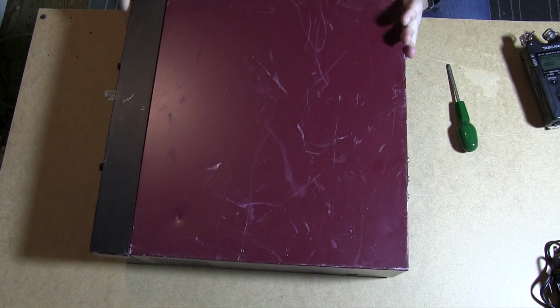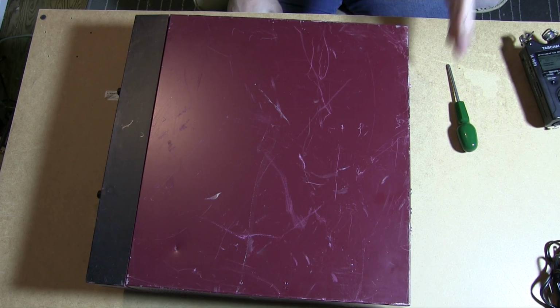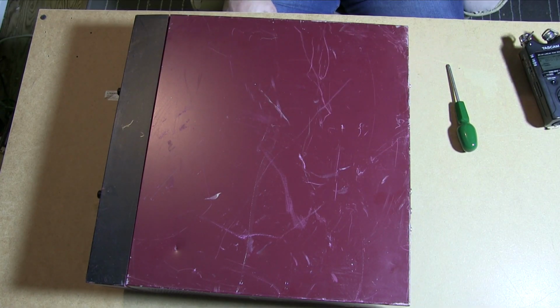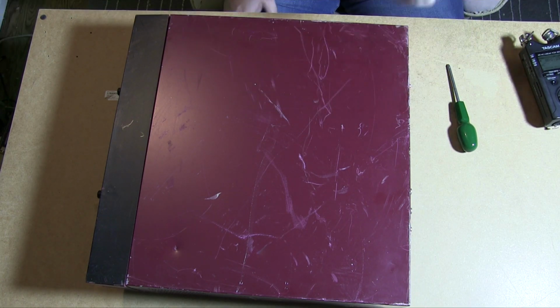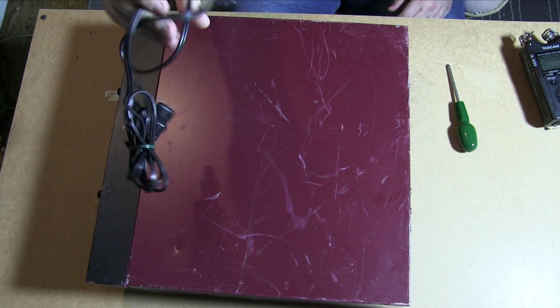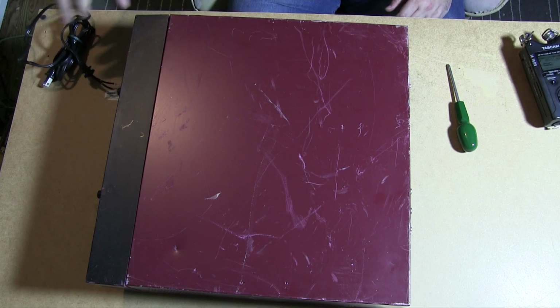We could potentially look into doing a whole PSU replacement, but to begin with, we just need to replace that lead. Now, obviously we need to replace it ideally with a Japanese lead, because we're going to have to, for the time being at least, run it at 100 volts. But to that end, quite easily, I found an N64 Japanese power supply. N64 power supplies, obviously, they just kind of slide out and you put in the power supply you need into the back. And from that, I have removed the Japanese lead. So we just need to replace this with what's left of that lead.